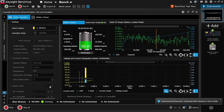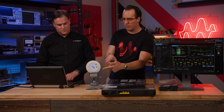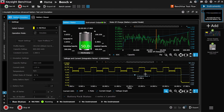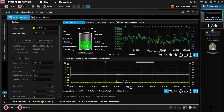You could hear it turn on and see the current spike — it drew about 108 milliamps. Now it's initializing and you can see the LED flashing. As the yellow is toggling, that corresponds to the power consumption of that LED. Now it goes into a lower power state where it's just taking measurements. It's both a CO2 and a smoke detector, so there are two different types of measurement levels you can see.